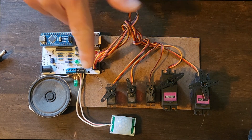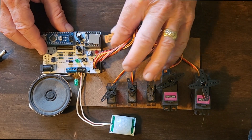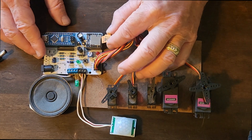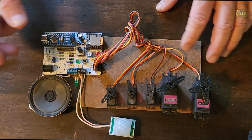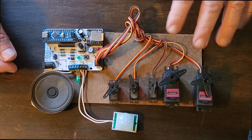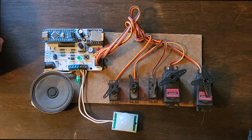I'm going to show you how to set the limits for the five servos and all the other settings on it. The first thing to do is to have your music selection — if you have ambient music or background ambient — and your voice files on your SD card. When you put the files on your SD card, make sure that the ambient sound is the first file you transfer over. That's important. You've also got to make sure you get a power supply adequate to run all five servos, which is a minimum of a 3-amp, 5-volt power supply.